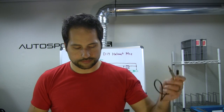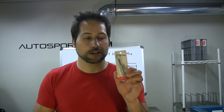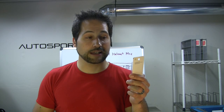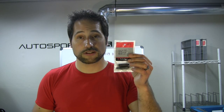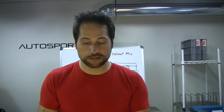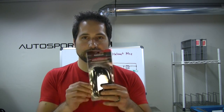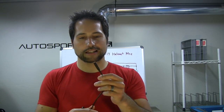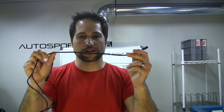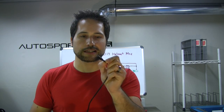So to summarize the parts: you need the surplus microphone from a computer recycler, and from Radio Shack or a similar electronics vendor you get a solderable stereo quarter-inch phone plug. For the earbud connection you can get a solderable inline eighth-inch phone jack, or — if you're lazy like me — just get an eight-foot headphone extension cord, cut off all but about a foot of it, and you get a nice molded pre-soldered connection that works really well. Two options there.